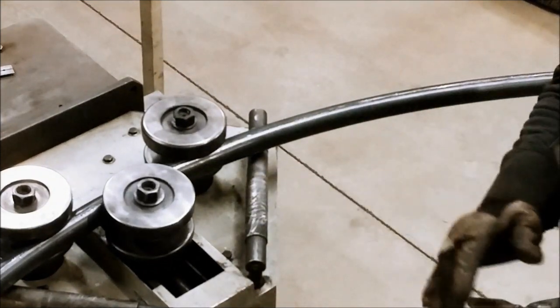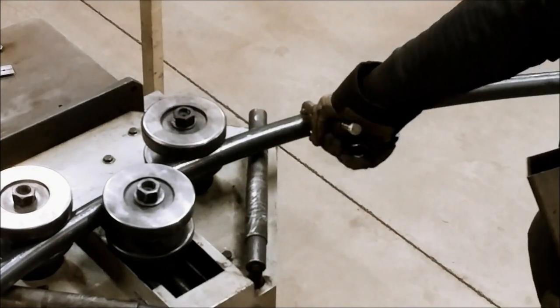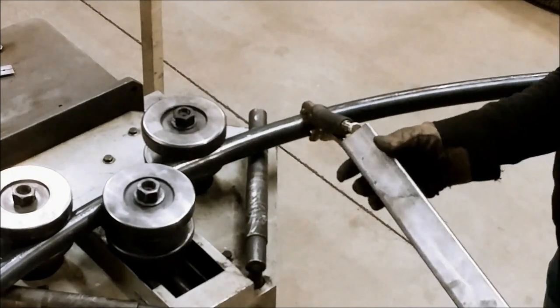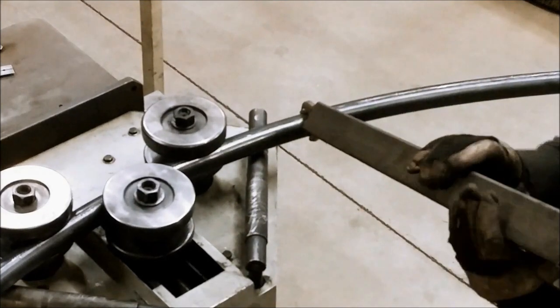If there are no side rollers, then you can use a vice grip with a pipe handle extension. Apply a twisting force, and it will create a handrail pitch. Do that at the same intervals and with the same force applied.